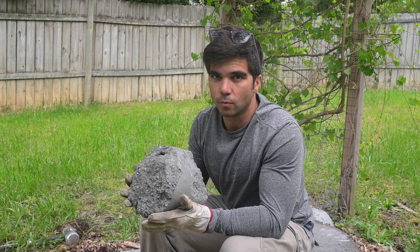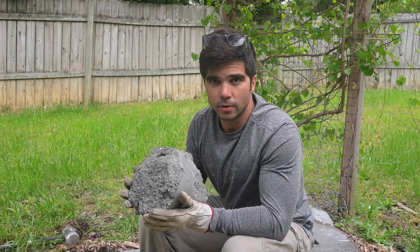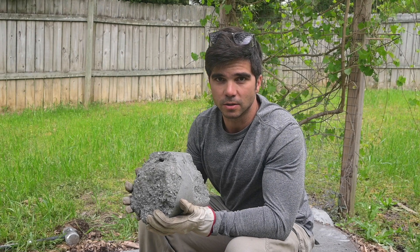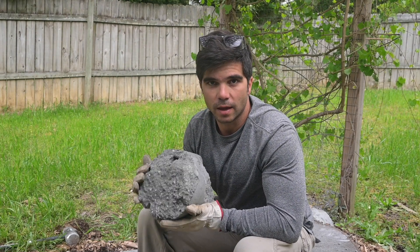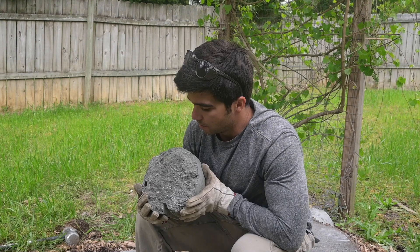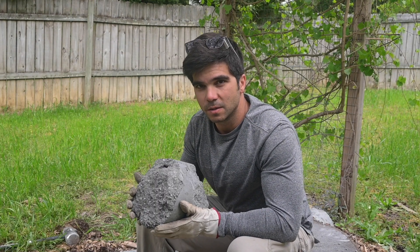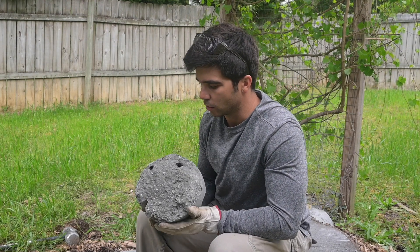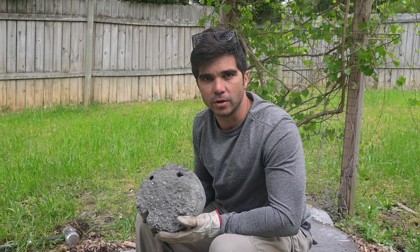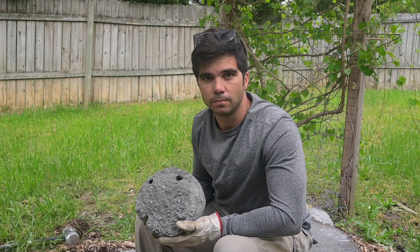To me, this is a viable option. I really don't want to rent a cement mixer, and honestly I don't feel like mixing concrete outside and then pouring it into the Sonotube — it's a big wear on my back. Sure, we need to improve it a little bit. Obviously putting some rebar in there will increase the structural integrity, and maybe finding a better way to mix it. The single piece of rebar worked to mix some of it, however we do have these air pockets which are a little bit concerning. I think we can get around that with a pretty easy option — if you guys have any ideas, let me know and maybe we'll include it in the next video. Thanks for watching.